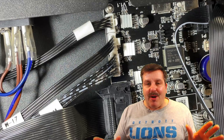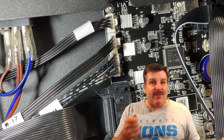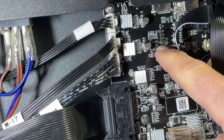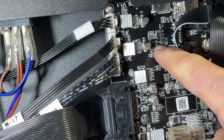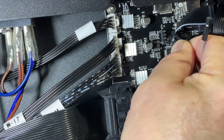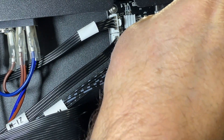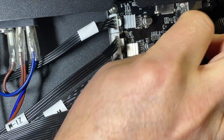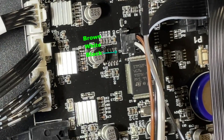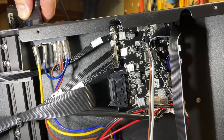Quick pause — the 3D printer is unplugged right now. Never reach inside your machine while it's plugged in. Inside the ET5X, find the motherboard. You can see the G marking there — connect them in this order: black, white, brown. Ground is the bottom one, then connect the white, and then finally the brown. Double-checking from the G: black, white, brown is the order.